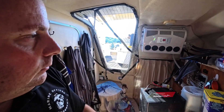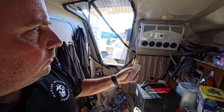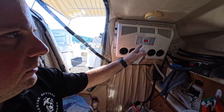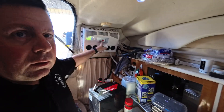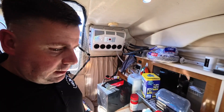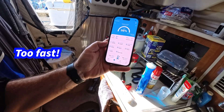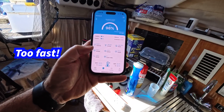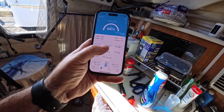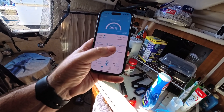We're going to go to Hercules mode. "3P" is as low as the cooling will go, and Hercules sets the fan as high as it will go. We've already dropped to 98% — 12.87 total volts, current almost 70 amps — this is 900 watts of power. It says one hour and 24 minutes until empty.